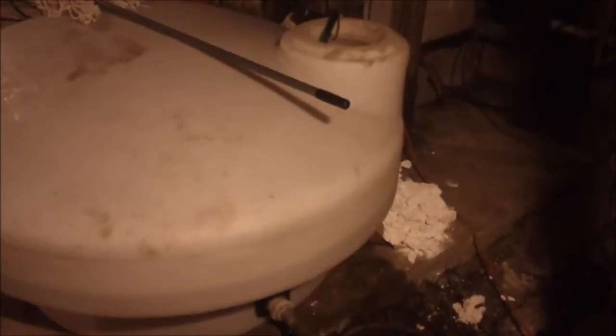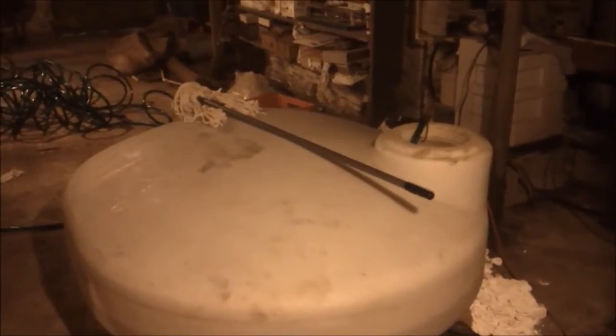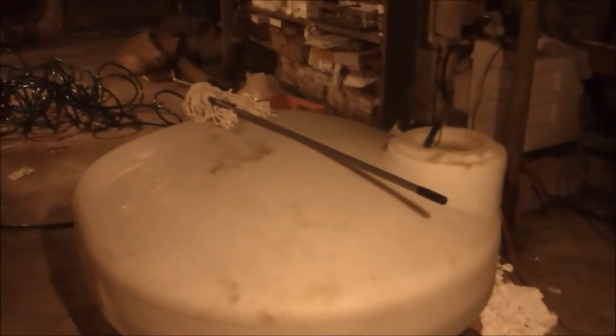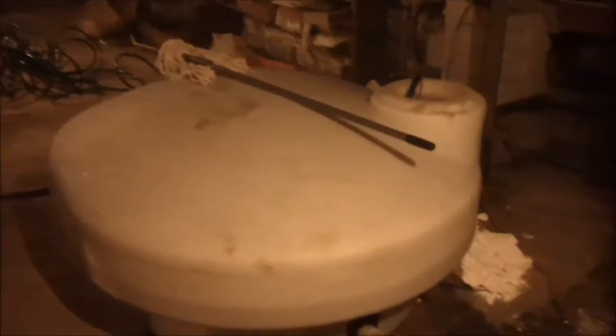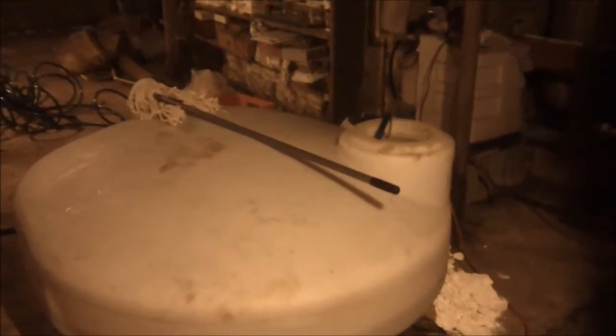It's about 250 to 300 gallons. I'm going to go get a shallow well jet pump, put it right on the end of that spigot there and use that to pressurize the house system. At least we'll be able to flush toilets and stuff for a while. We'll just have to add to our daily farm routine — fill the tank from time to time, daily or every other day. We don't know how fast it's going to use water, but that's all we can do for now until we can come up with a plan to replace the well.